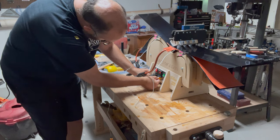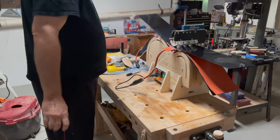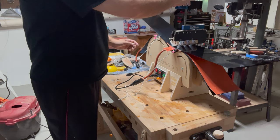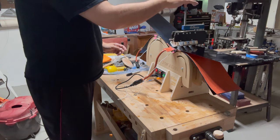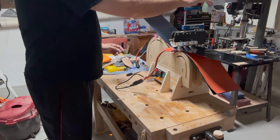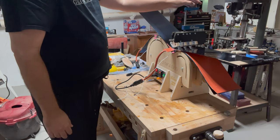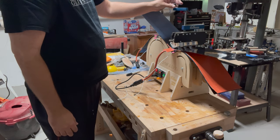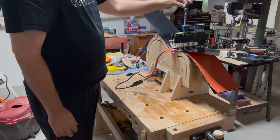What you're going to do in the process is heat up the waist and then bend that first. As I'm going around and just twisting this crank down — I probably took five or six minutes to do this step. This is the tightest curve on the entire project, so I wanted to make sure I took my time and didn't snap the wood.